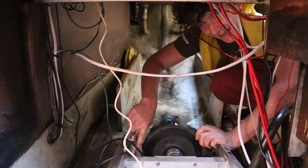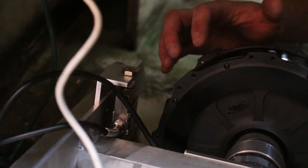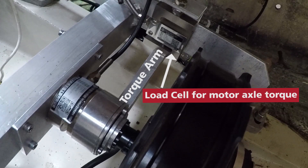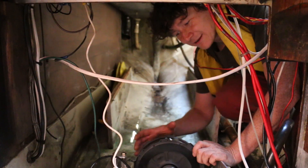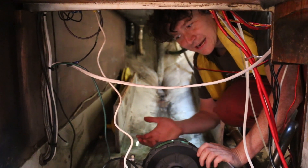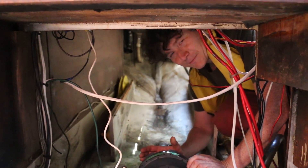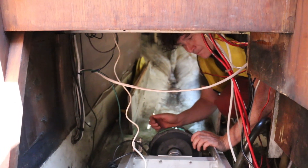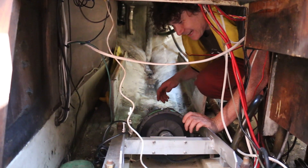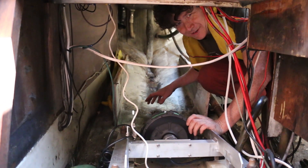The other load cell on the side is hooked up to a torque arm. All the torque of this motor is now coupled through this torque arm to a measuring device, so I have a super precise measurement of how much torque the motor is putting on the propeller. Given that we know the RPM of the motor and the torque it's producing, we get another very exact power measurement — the mechanical power output of the motor.